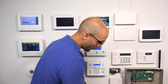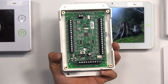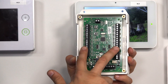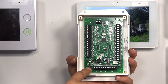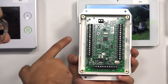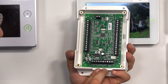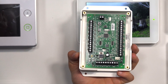Let me take it out of the box so you can get a better look at what the device looks like. So this is the 16S. This converts 16 hardwired zones into wireless zones. These two terminal blocks on either side are going to be where your actual zone wires land onto. Around all the screws on the entire device, everything is labeled and it's going to tell you what to do. I can see that it says which zone is what for each of the screw pairs going around the whole thing. On the bottom, you'll see that it has its power input, there are two auxiliary ground outputs, and then you actually have a siren out on this device too. It's a very versatile device, and it's great to use.